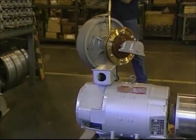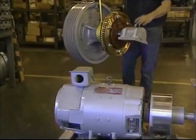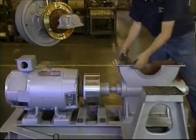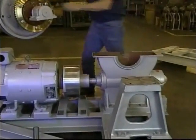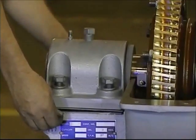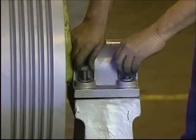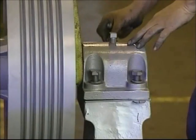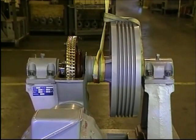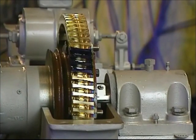Now put the center assembly back into the machine. Carefully lift the assembly into position. Match and place the shims and shim plates with their previous markings on each side of the lower housing and outboard stand. Line up the shim plates under the bearing blocks and make sure the shims are squarely underneath. Then loosely insert the four mounting bolts on each side. Push the locator pins in the shaft support blocks by hand; after final adjustments, they must be tapped in with a hammer. If a major adjustment is necessary, these pinholes must be reamed. You can now run the machine, but you will still have to make adjustments to duplicate the pattern on the gear.